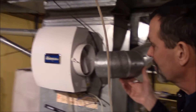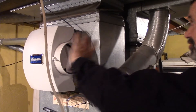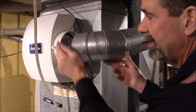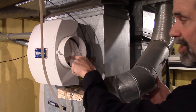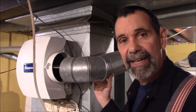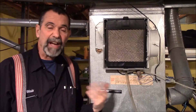This new unit is six inches and the old one was five inches, so I have two options. If this were a bigger house and I wanted maximum airflow, I'd replumb with the six-inch pipe. But this is just a 1,100 square foot condo, so I'm going to use a six-by-five adapter to hook up the ductwork. We're on summer mode now, and for winter mode we put these two together with the reducing adapter. There it is — in less than an hour I've gone from an old drum humidifier to a newer flow-through.